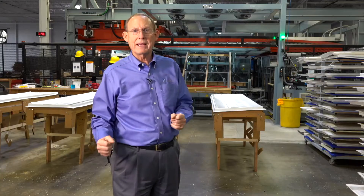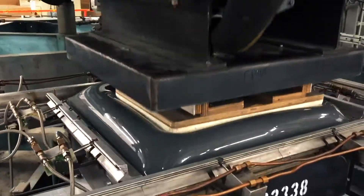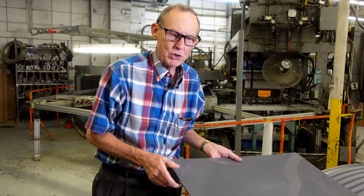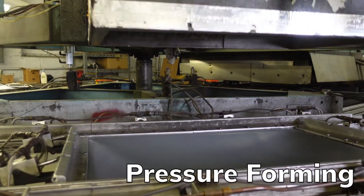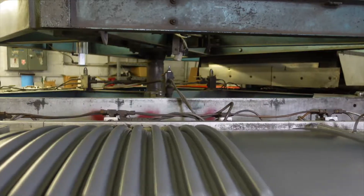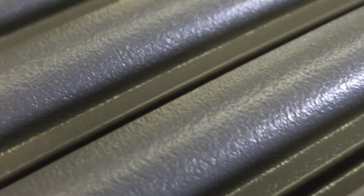All of this is vacuum forming — all of the material is heated and then vacuum evacuates the trapped air. In some operations like this, we use a female mold and we do pressure forming. Pressure forming is the science of adding 120 pounds of compressed air to force this smooth material into this tool to pick up this pressure and this texture.